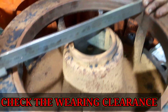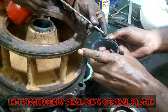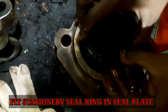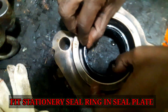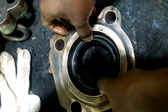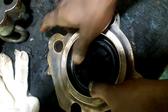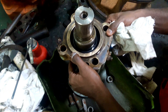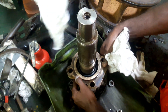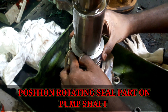Now we will see how to box back the pump. When assembling a mechanical seal to the pump shaft, ensure that the pump shaft and all seal components are clean. Pay particular attention to the seal surfaces. Ensure all seals are serviceable and lubricated prior to assembly. Lubricate the pump shaft with lube oil. Slide the seal plate on top of the pump shaft with the stationary seal fitted.